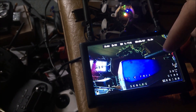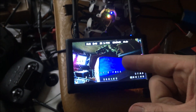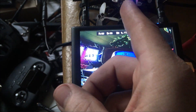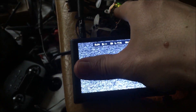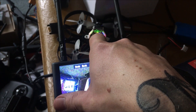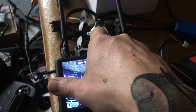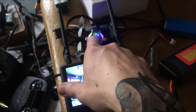I'm going to press it again — pay attention to the blue light above my finger. We just switched over and now we have much clearer FPV footage. I'll press it again so you can see that blue light — every time it switches milliwatt output, it changes. Now I'm crystal clear; I think that's the highest milliwatt. So we went from zero, one, two, three — I'll press it once more just to confirm — and now we're on zero milliwatts. Why they even offer that as an option is beyond me. Long-holding it jumps through the blues one at a time.